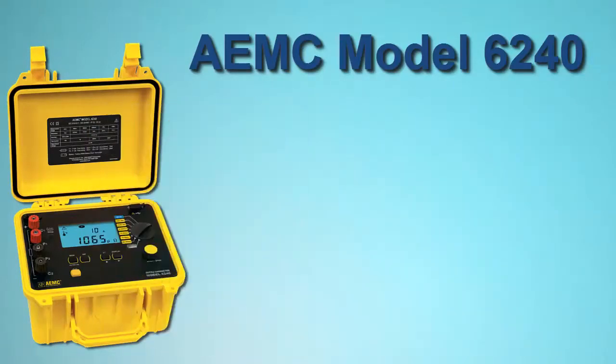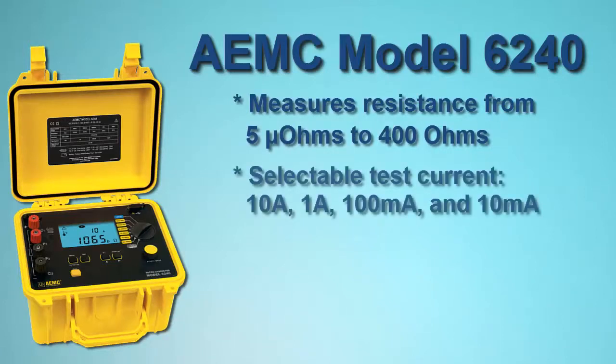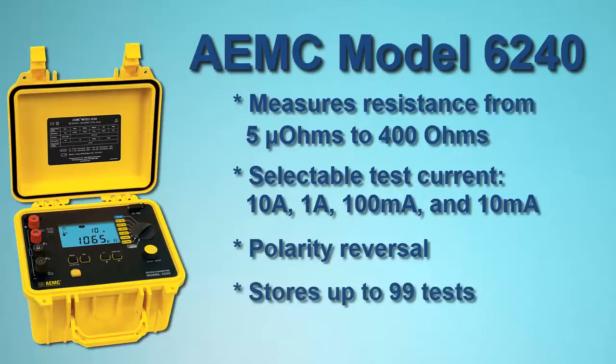The Model 6240 measures resistance from 5 microohms to 400 ohms. The instrument provides selectable test currents of 10 amps, 1 amp, 100 milliamps, and 10 milliamps, and includes a polarity reversal function. Up to 99 measurements can be stored in memory.